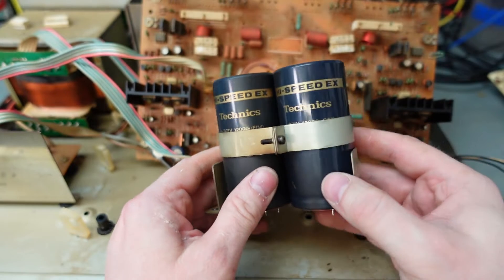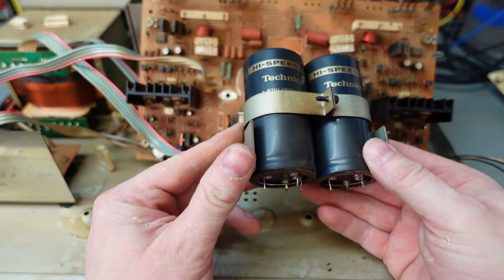The final operation for cleaning is drying. Water is another problem — to make it disappear, ideally you want to boil it off at over 100 degrees. The problem is a lot of plastics and components won't like that. A lot of capacitors are only rated for 85 degrees — I know that's a working temperature, but it doesn't sound great to heat them up. So capacitors, especially large electrolytics, are the ones I tend to take off, especially if they're good or valuable ones — some of them are quite expensive, so just don't risk it.